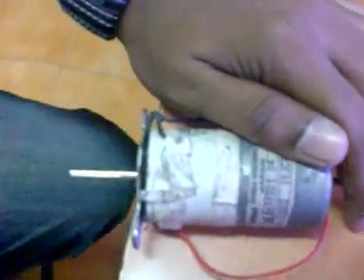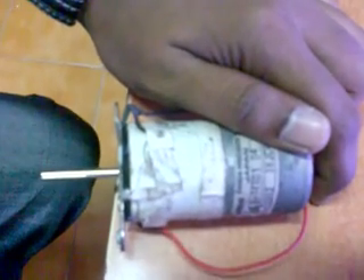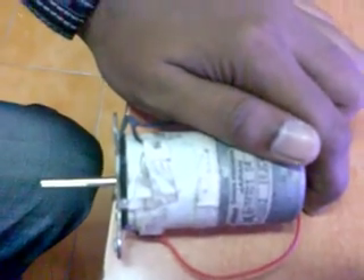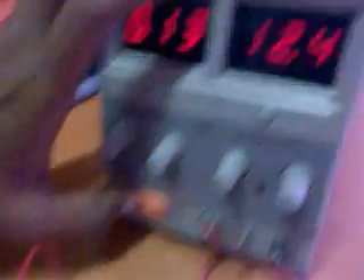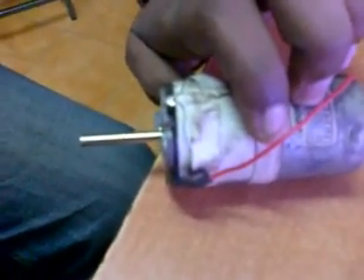This video demonstrates the DC motor which we have procured. It is a 12V DC motor which can operate up to 24V DC with 0.2 HP of power. This has been connected to a regulated power supply (RPS) for the first requirement, that is, to check the RPM rating of the DC motor. As you can see, the supply has been given to the DC motor and the shaft has started rotating. We are using a DC tachometer to find the RPM rating, and it has been connected to the shaft of the DC motor.